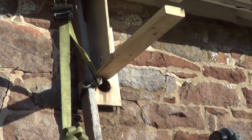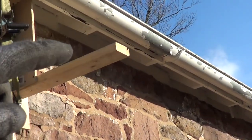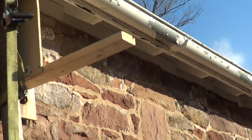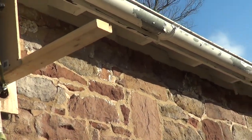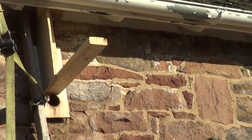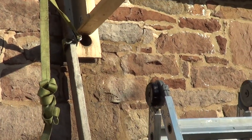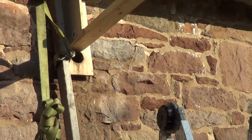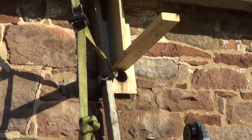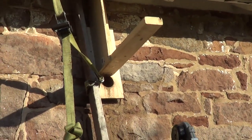You can rent a core drill which has a rack and a little pinion and a handle — pushing it by hand is going to be really tough. So I just used a come-along. I made a jig to keep that hole straight, because you don't want to drift when you're drilling. You're still binding on your drill, but it's pretty easy to do by hand.